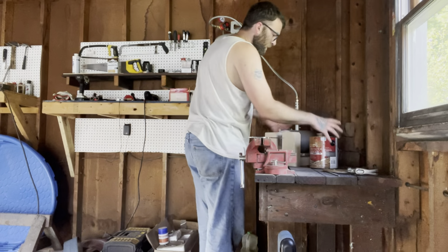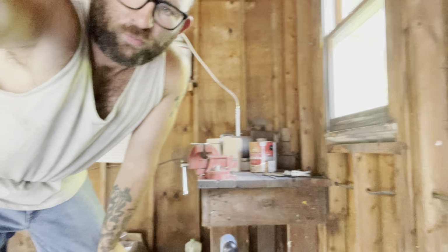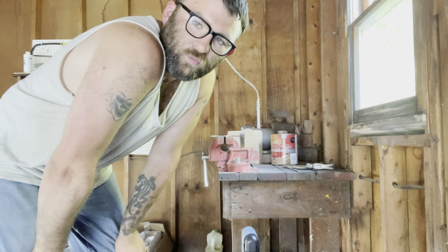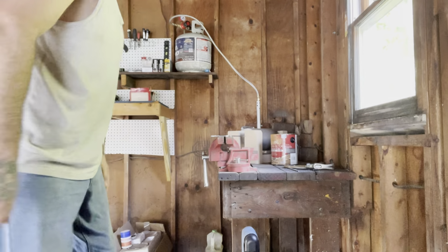Now guys, got my can of quenching fluid, my canola oil next to that forge so that it preheats a little bit. That's what you want. Like I've said before, 120 degrees, 130 degree oil. That's perfect stuff. So let's get this thing fired up.